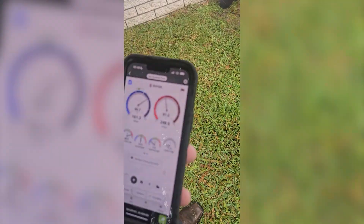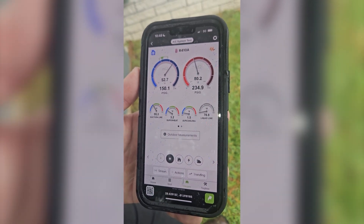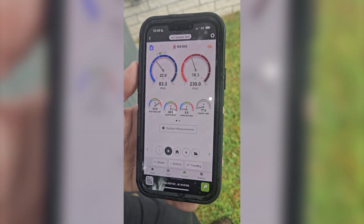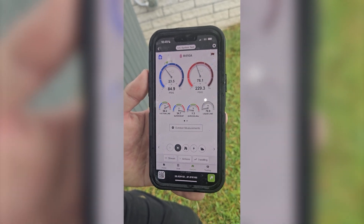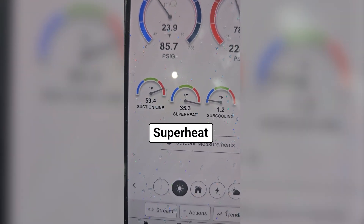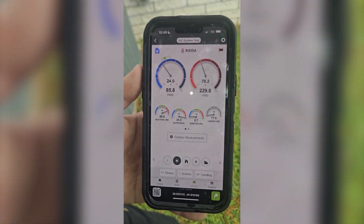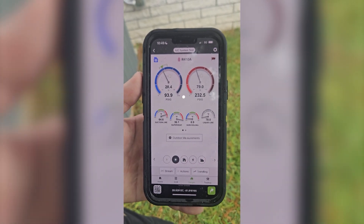It's alive! Don't freak out if your suction pressure drops immediately because it's all wet — it will come back up. That's a wet coil, not a low charge. And then it bounces back. Watch as your suction saturation increases — your superheat will go down and your subcool will come up as the system runs. Thank you for joining me on Adventures with Elliot, where every call is an adventure. I'm going to go do a leak detection because these pressures are not coming up, but we'll catch you next time — and hopefully things will go according to plan, even though they never do. Anyway, have fun out there, guys.